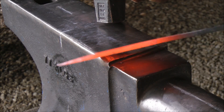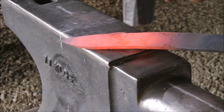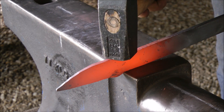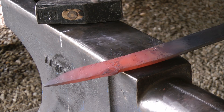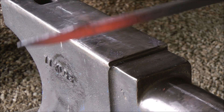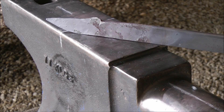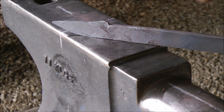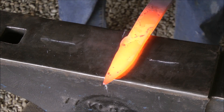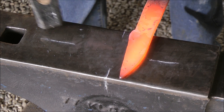It is nice in the middle of my bar of steel. I just want to clean up that little corner there on the edge, and then right above it. So now I've got a sharp little corner there, and to take care of this bowing on my anvil — when you're doing this, hammer that, but be mindful not to hammer the heel of the knife. Now I'm just going to draw out the rest of my edge.